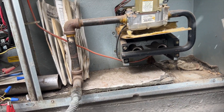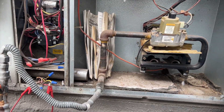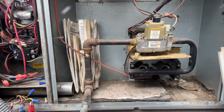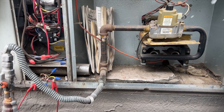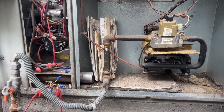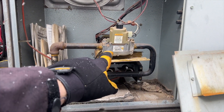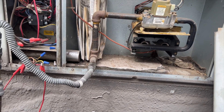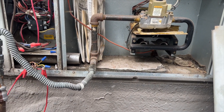It died today. This unit does have a pressure switch, so we need to check if that could be the issue — it could be dirty or failed. We're not getting igniter... there we go. We didn't get ignition but the igniter did come on. The pressure switch is closing. I did hear the gas valve clunk, so maybe it's stuck, or maybe someone didn't pay the gas bill.